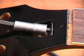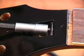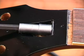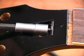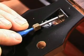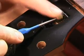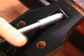So I'm just going to run the die on to the thread. It'll catch and get a feel for it and start threading on. This is called chasing. If you have rust, paint, or dirt, it'll take that off too and cleans up the thread so you get a fresh start. Those threads are sharper now and that nut will go right on. It solved that problem in a hurry. That's how they should work.